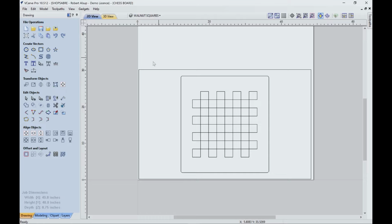This is going to be a fixture board, and I believe it's 30 by 48. And that's going to go on the front zone of our machine so we can put all the vacuum on that front zone. And then it's going to get vacuum from the table. So that's how things are going to be held.